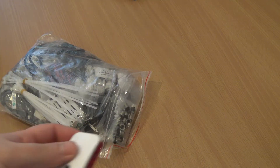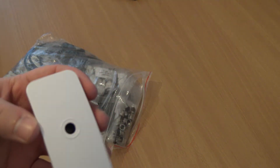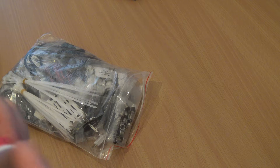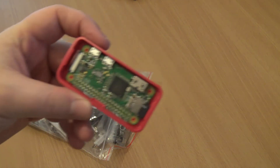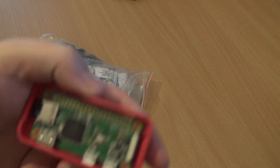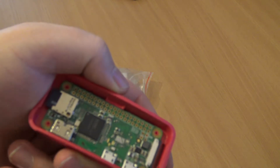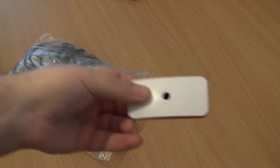The first thing we're going to need is a Raspberry Pi. I've gone with a Raspberry Pi Zero W — the wireless and Bluetooth version — on the basis that they are just a lot smaller. I got this used; someone else had tried a project with it, it came with an 8GB card. It has no pre-soldered pins so I can solder straight onto the board, which will do me fine.